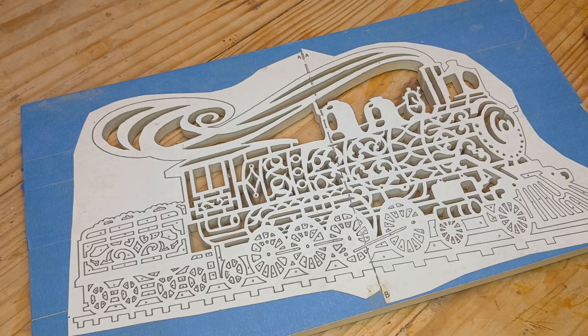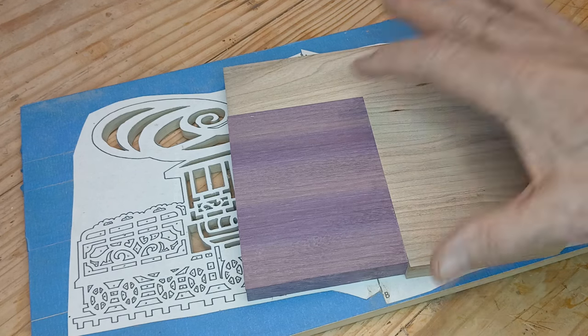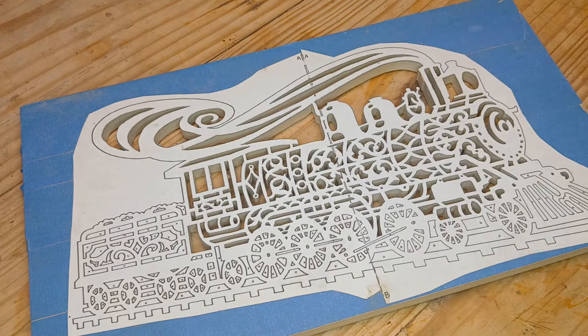I very seldom get above a 7, even in a dense wood like this, though I won't hesitate to go to a 9 for a big cut. Depending on the brand of blade, some of them kind of grab — if you've got a skip tooth blade and a thick cut, it can grab the piece and bounce it on you; I've had that happen. Anyway, I hope I've answered that person's comment — they wanted to see how I choose the blades. If not, ask again in the comments and I'll re-clarify. I hope to see you in the next video.